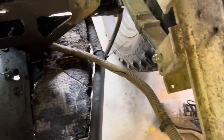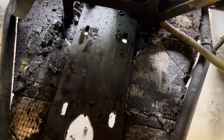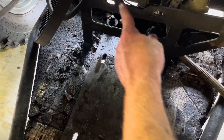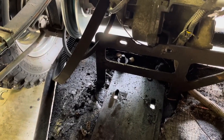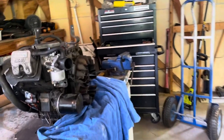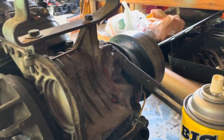You can see oil actually sitting down there and it happened pretty quickly — I don't have a ton of it since the previous gasket break left a truckload of oil. Right here is where the two back bolts of the motor go through. I'm going to cut a notch on each of these before I put it back in case I ever have to do this again, because they are a pain to get out. You can see where those four mount bolts are — I screwed them back in so I don't lose them.